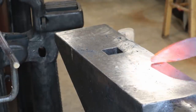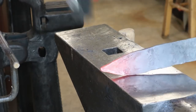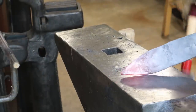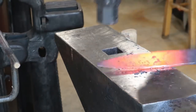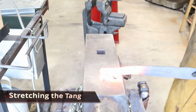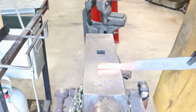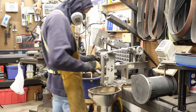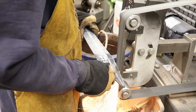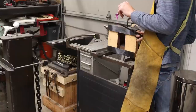It's looking pretty good at this point. After I get it drawn to a point, I'm going to continue to flip it flat and start to thin it out at the same time. You're slowly moving the material in all directions trying to achieve a nice symmetrical shape. It appears I will have enough material to make a sword. Now I'm going to forge out the tang — this is going to be a hidden tang sword with a screwed-on pommel nut. We took it as close to completion forging as possible, keeping as much material as we could out of that spring.